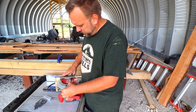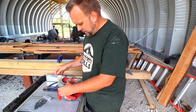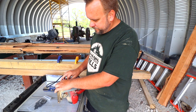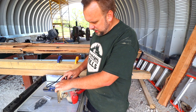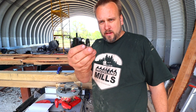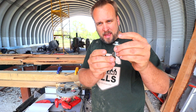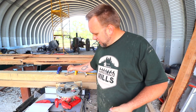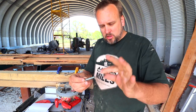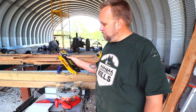The little paper stapled to the front says quick tips, and I did read them. It says you don't remove anything but the saw blade. If there's any kind of washer or anything under the blade on your saw, leave it there. After you take your saw blade off, you'll match the threads on the bolt that came with your saw to this longer bolt that came with your new kit — whichever one the threads match, that's the one you need. Then you'll take a beveled washer that also comes in it, put that through, and that's what you use to bolt your new beam cutter on with.